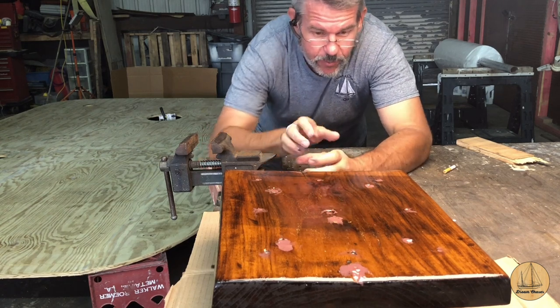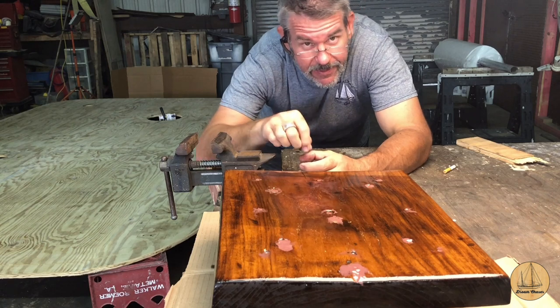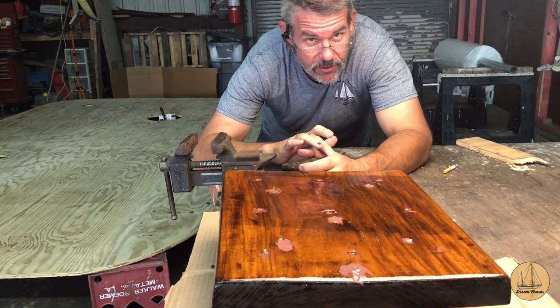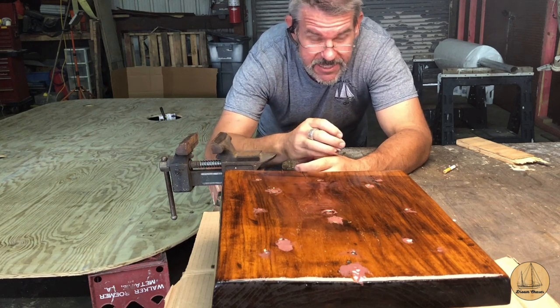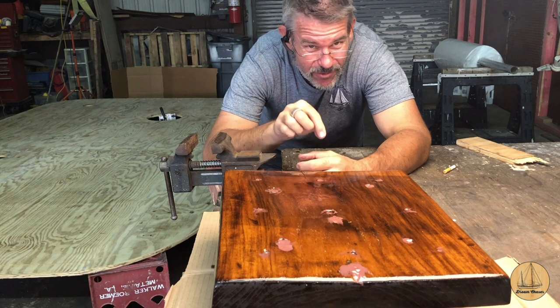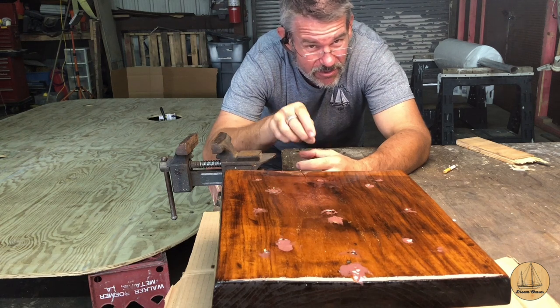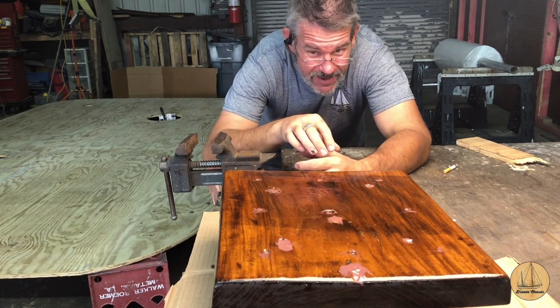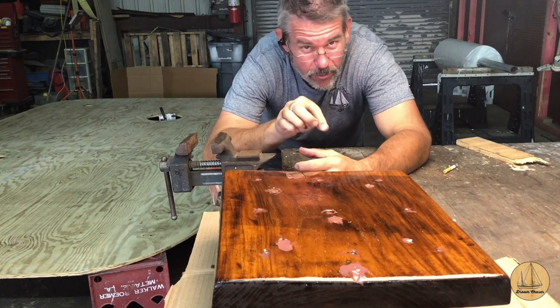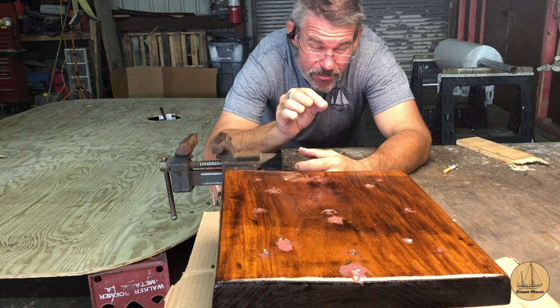And I think what's happened is when I pull the mason jar lid off and clean the brush on the top, a few of the little bits of varnish hardened along that lip, and it prevented it from getting a great seal on there. Still, the varnish is in good shape, but I believe there were a couple small spots that got solidified or maybe fell off of that rim down into the material. So as I was running along the top of the material, I was seeing what I thought were bubbles. What I actually think they are is very, very small solids.